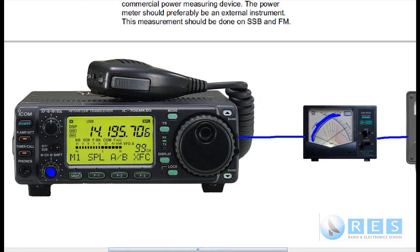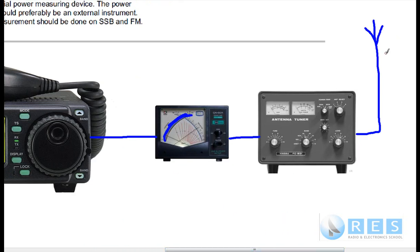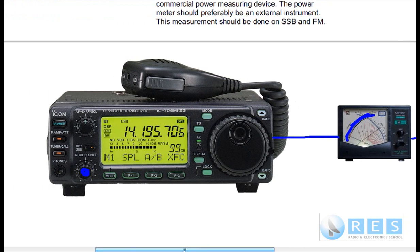I'm going to talk more about the cross needle SWR meter very soon. You would have your transceiver connected to a watt meter, connected to an antenna tuner or a dummy load. If connected to a dummy load, you wouldn't have to use your call sign — just transmit and adjust your microphone gain for the power you want on the watt meter. If you're going into an antenna, you need to do competency 10 again: 'This is VK4FABC, is this frequency in use?' Then make a test transmission — 'VK4FABC testing, 1, 2, 3' — count as long as you like and adjust your microphone gain until you get the correct power level on your commercial watt meter. It's not that particularly hard. That's all you need to do.